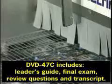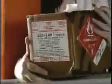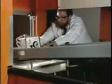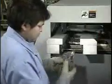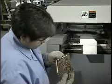Because of these problems, these flux residues must be cleaned off the assembly as soon as possible after wave soldering. Some companies have no clean processes where low residue fluxes are used. These fluxes are much less active. This means that the residues can be left on the assembly after soldering without causing deterioration. Low residue fluxes require that the surfaces to be soldered exhibit good solderability characteristics.